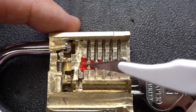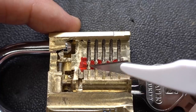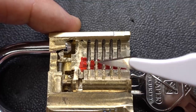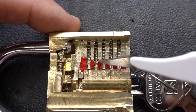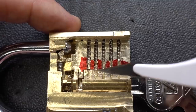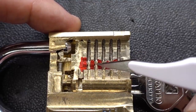What you see here, in chamber number five, we have a very small spool with a very narrow waist, and one end is thicker than the other. So the top here is actually thicker than the bottom. And that's kind of neat, because when you look in chamber four, it's exactly the same pin, except it's been inverted with the thick part on the bottom and the thin part on the top. You would think that that would give you some varying feedback.